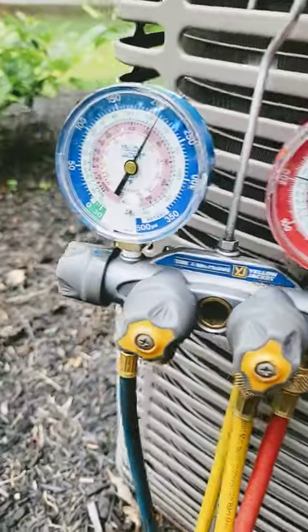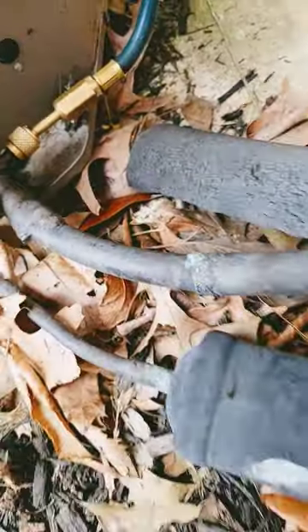What's wrong with the AC? We've got 245 volts going to the compressor and the fan. We've got refrigerant but it's equalized. Looks like the compressor is not pumping. No condensation.